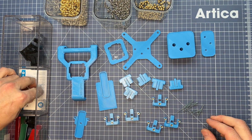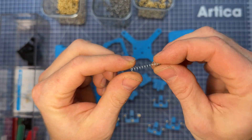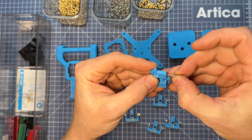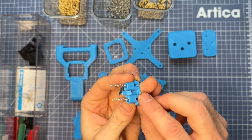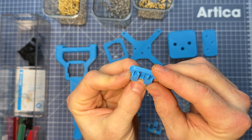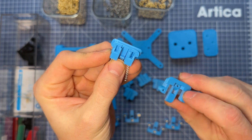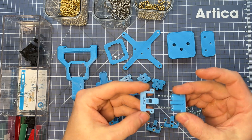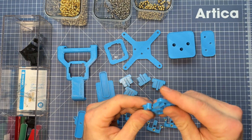Next, let's continue to assemble our mechanisms. Grab all of the spring parts you have purchased for your assembly — here's a close-up showing that a pen spring will work. Grab the top mechanism and insert one spring per hole. The top mechanism is designed to slide over the bottom mechanism and engage with the snap feature. The bottom mechanism has a center stem and a hole, so make sure when you slide it over those two parts are engaged. Line up your springs with the bottom mechanism and use the stem to align it.